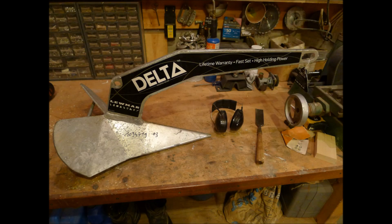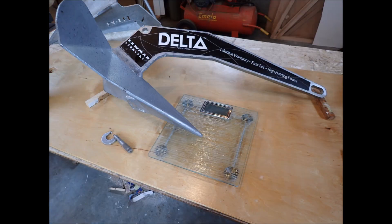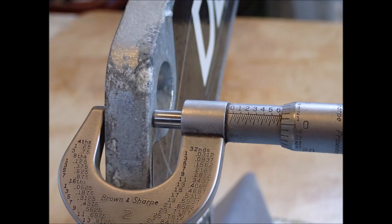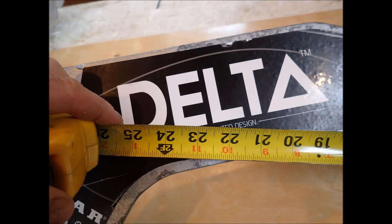This very popular anchor came out a little heavier than advertised at 46 pounds. The tip came out at 10 pounds for a tip-to-total weight ratio of 22%. The shank scantlings are generous — there's plenty of width, plenty of height, and the lever arm is not too long, so I'm not too concerned about the strength even though we don't know the grade of metal. However, all that metal in the shank will do nothing to help setting, as it certainly lessens the tip weight.